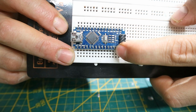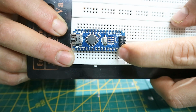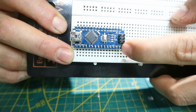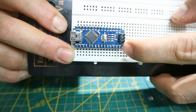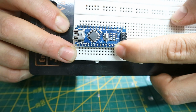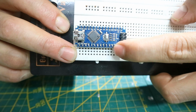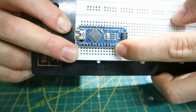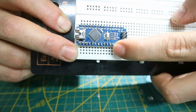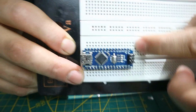Then you have your reset, your ground, that's where your black one, your minus cable, will be your negative, and then there's also the V in for one if you want to go 12 volts and all that. But right now we're going to focus on this 5-volt stuff, because that's easy to connect with a battery, and my LED strips are rated for 5 to 6 volts, so let's just focus on that one. And on that power line we showed you earlier.